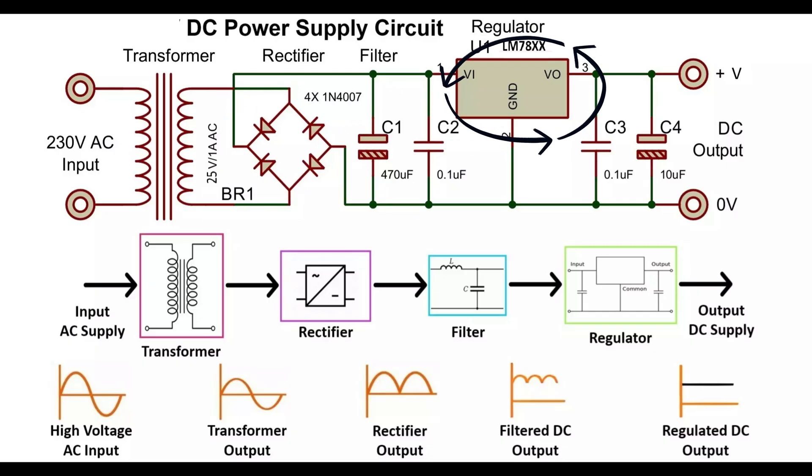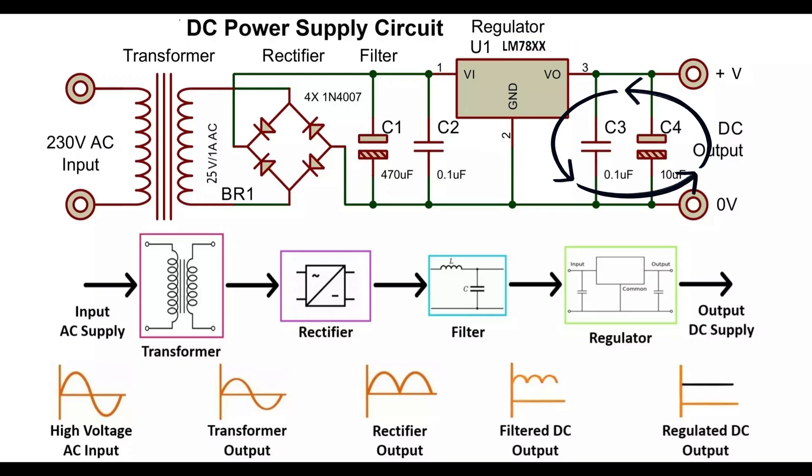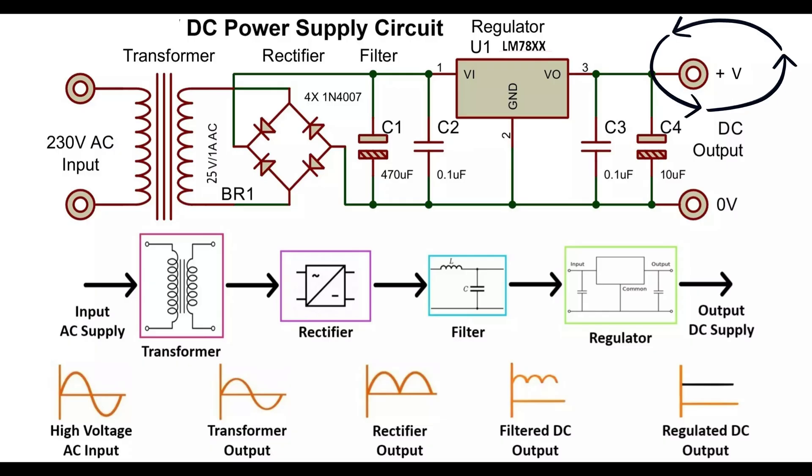The selection of the AC input voltage must be set at least 2 volts higher than the 8-volt DC regulated output, which aids in the selection of the step-down transformer. Usually a transformer that steps down 120 volts AC to 25 volts AC will work, but you could go as low as 10.5 volts AC.